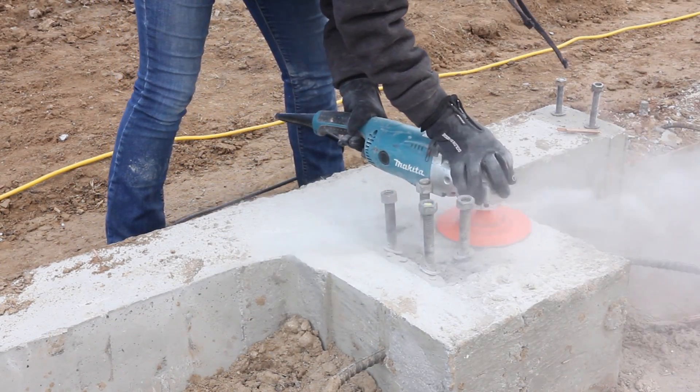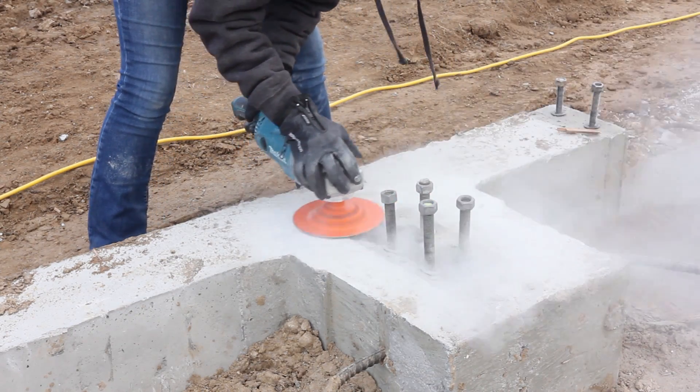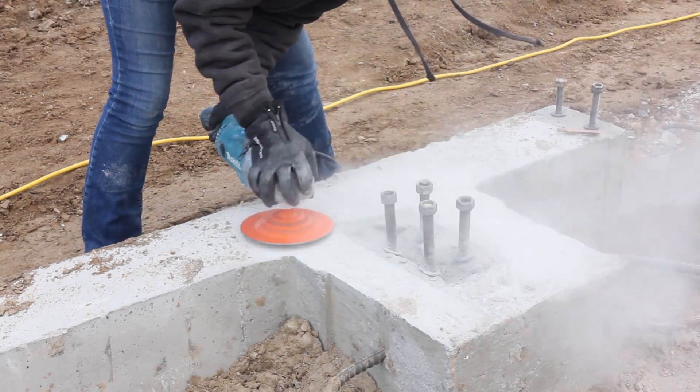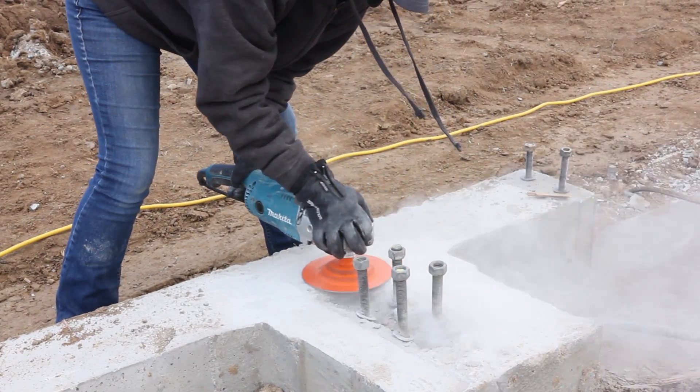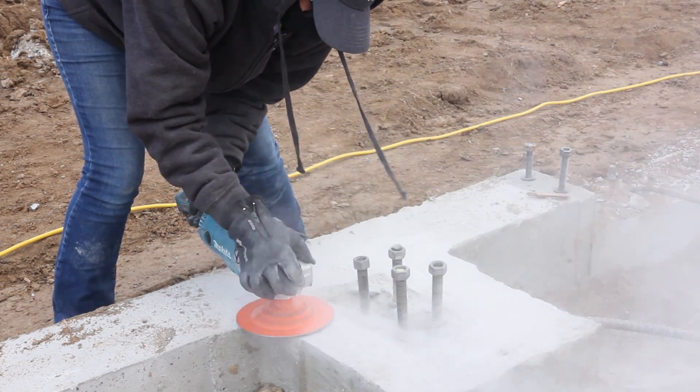You can then use a big pry bar to lift up any low columns and hammer shims under as needed. One last thought: it is always better to bring low columns up, but you may find that you just have to bring something down. If necessary, that may mean you need to grind some high areas. This is up to you, and as I've already mentioned, give us a call if you're unsure. All right, I'm on to the next video where I'll go over some ways to correct for misplaced bolts — that'll wrap up the anchor bolt videos. Then we'll get into setting some steel, probably next week. Build great and I'll see you next time.